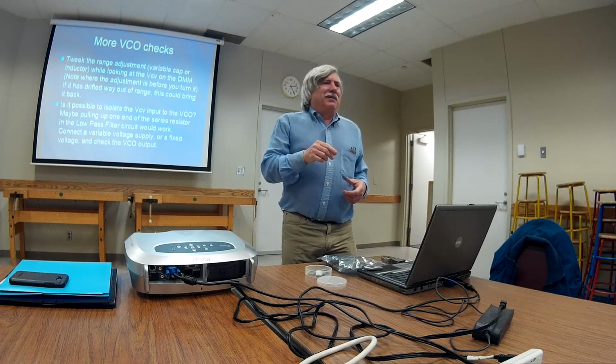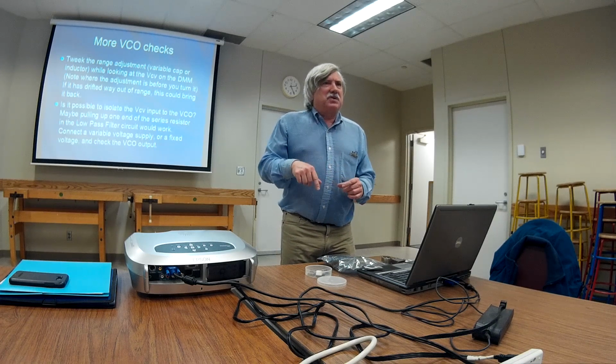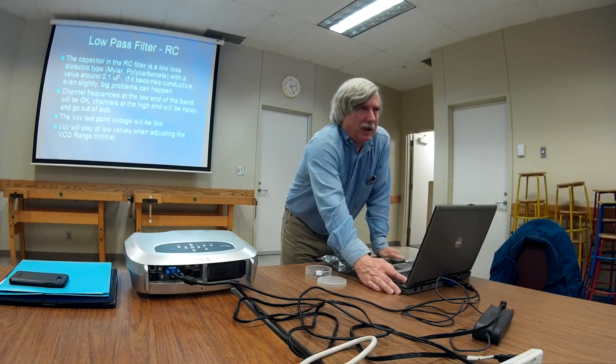So you'll see that. Oh, and of course, you guys already know this, but if you think that your VCO is out of range, like it doesn't work on the high end or doesn't work on the low end, and you're going to go in there and tweak that inductor, you've got a line on your fiddlestick adjustment tool. Remember where that line was, because if you tweak your coil and it doesn't do anything, and then you forget where it was, well, now you've got 2 problems instead of 1. So you just keep that in mind. Been there, done that, got the ball peen out.